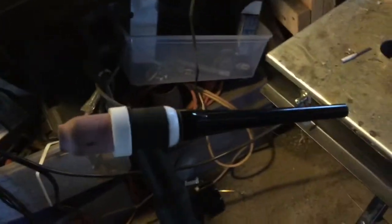All right, so this is concluding my video on the CK SuperFlex torch cable and the new TIG torch. Let's start with the cable first. I love it. I don't know what I did without it. It's super lightweight. It's super flexible. The torch is an average torch. I dipped in my tungsten, and I have to clean that before I come out and TIG weld again. But it's an average torch, and it works great. It's not a flex head, but I didn't really use the flex head feature anyways.